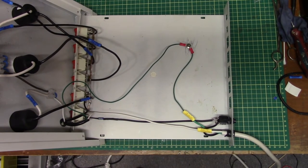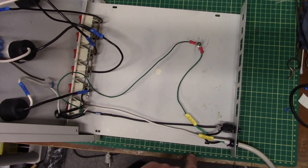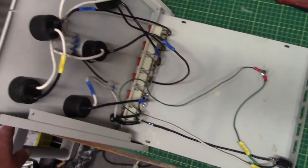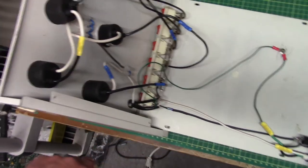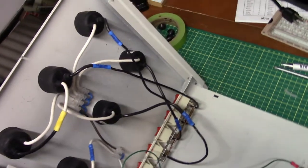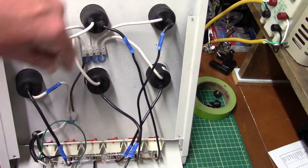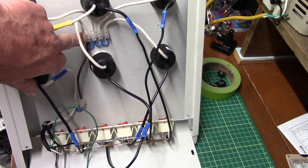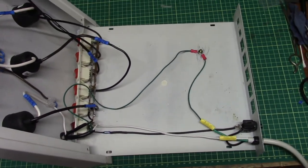Here's a final shot of the interior all wired up. I kept the circuit breaker in line. I've got my grounding points — this one coming directly from the wall socket, this one coming back out from the two sockets over there. The line voltage comes in, then goes out to the switch and socket and back in again, then to the switches as they switch in. On the top part they're all nicely arranged with nice big crimps, and then a 250-volt euro-style strip there for the first bunch and another strip down below. All I have to do now is close it all up and we should be good to go.